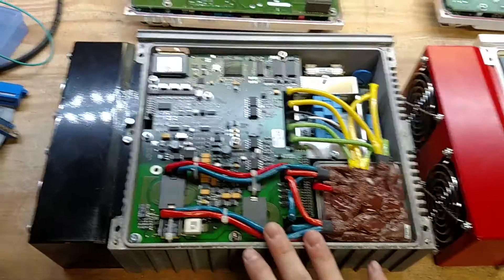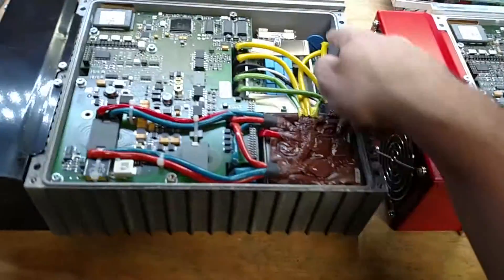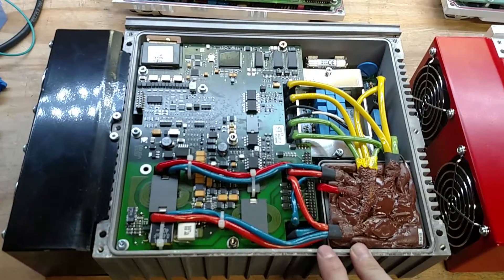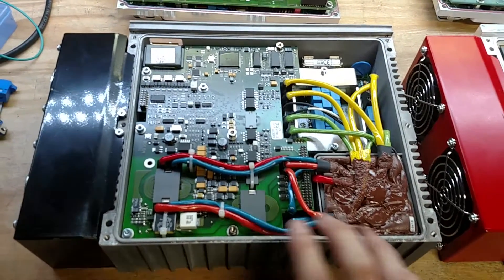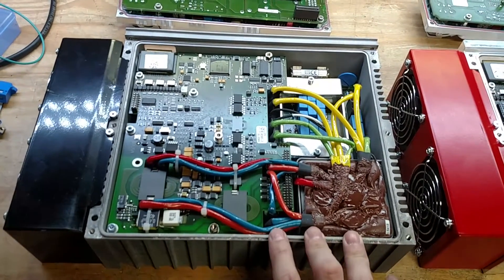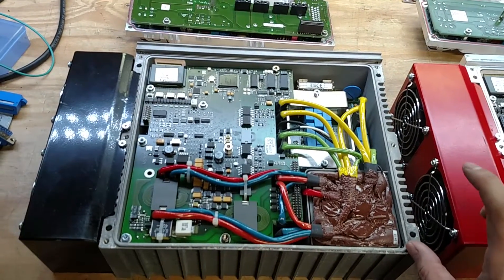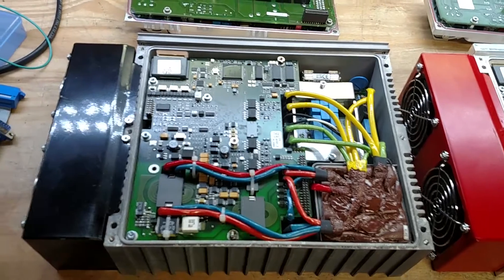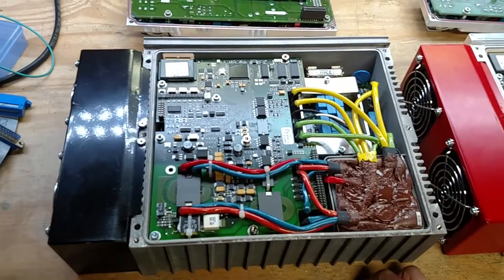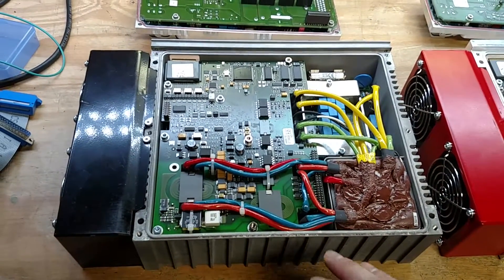The main reason I'm interested in this is — if you look at how shallow this thing is — this square footprint is the same as my NLG411 battery charger. So the 4th gen charger and this 5th gen have essentially the same footprint, and I can stack a second one on top. My other one is 3.3 kilowatts, this one is 3.3 kilowatts, so stacked I'd be at 6.6 kilowatts. That works with the J1772 port I've got — it's a 7.2 kilowatt port for level 2 charging. So I can essentially charge at twice the rate and the battery charger takes up pretty much the same exact space in the truck.